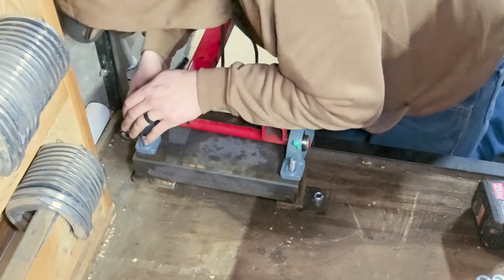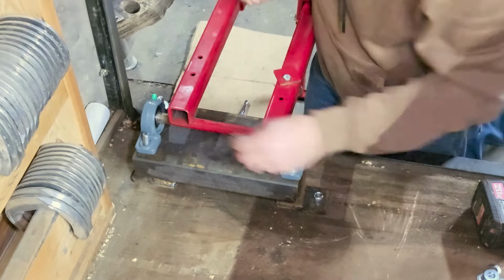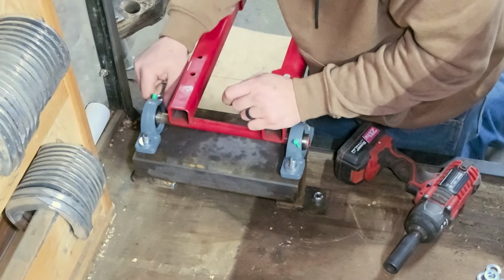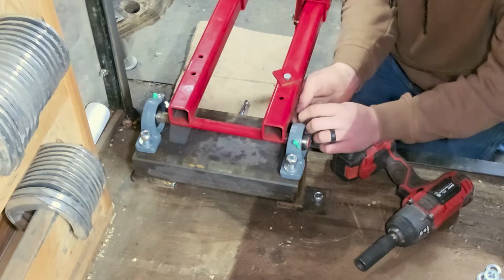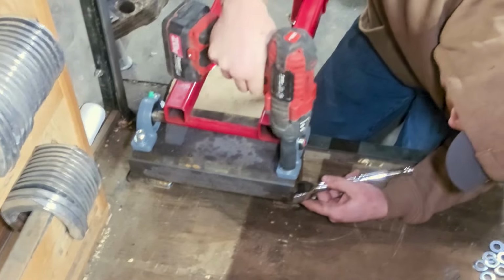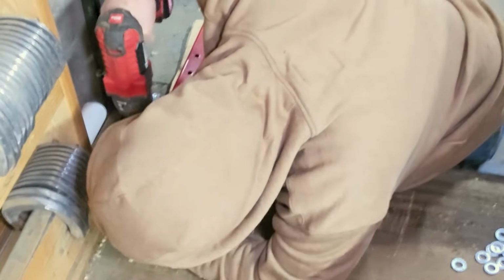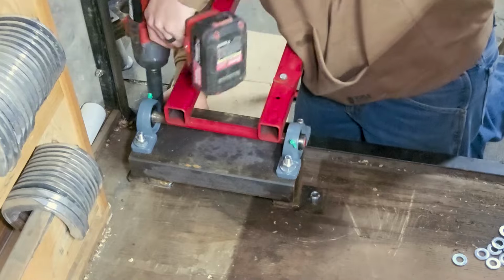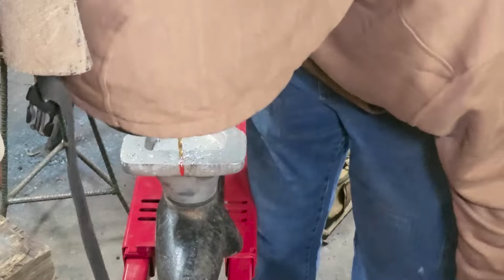When you're mounting your Vanvil, you want to keep the surface you're mounting it to, whether that's the trailer or the van, at roughly 19 inches. So if you're a little low like my trailer is, that's why I built a platform to mount it to, so that it sits at roughly 19 inches off the ground. This makes it so my anvil face sits around knuckle height, which is right where I like to keep my anvil. So for everyone out there, if you're a little shorter, you can mount it a little shorter. If you're a little taller, you could build it up a little more.